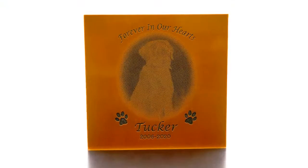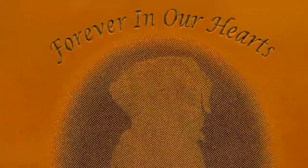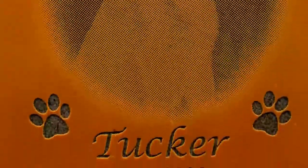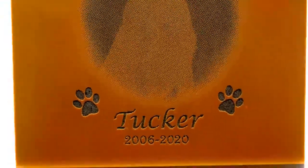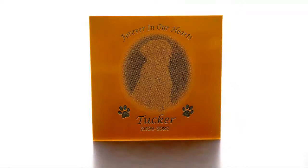After we've engraved through the mask, we now have a perfect template or mask for the sandcarver. So here's a nice close-up shot that shows you all the little dots that will basically allow the sand material or substrate to kind of punch through this mask and then allow us to actually produce that depth into a material like granite that just can't be done any other way.